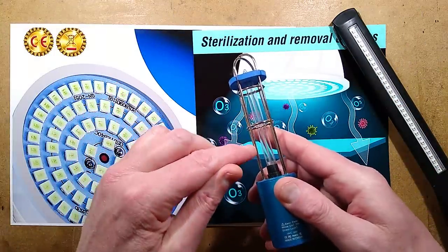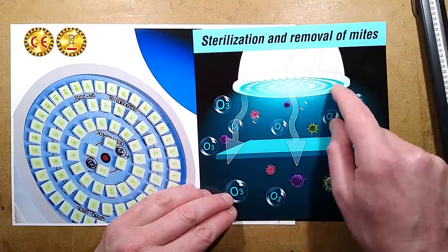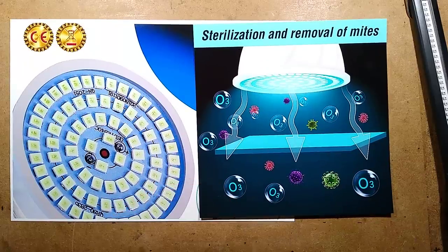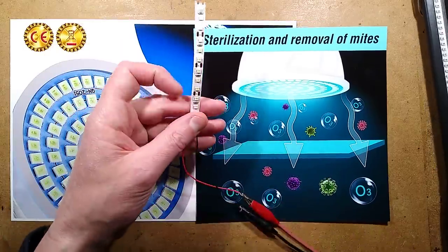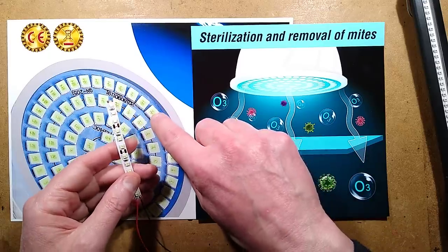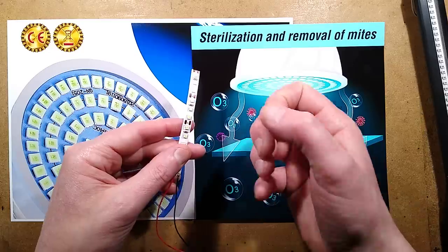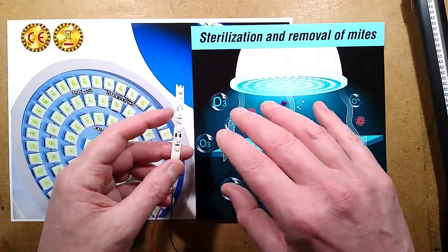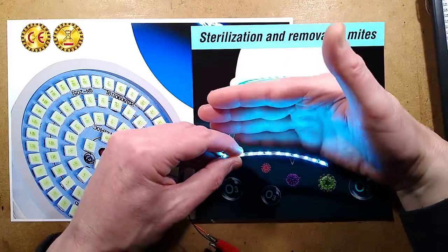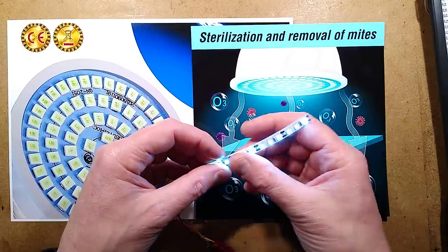These ones are real. The ones with the glass tubes are generally real, the clear glass tubes. But you notice how the colour is very similar? I was thinking, so what are they using then? And I saw these LEDs and I thought, oh, I know what they're using. They're using ice blue LEDs. Ice blue LEDs are basically the same construction as a white LED, but they use the blue chip or an ultraviolet chip, but instead of using tons of the yellow phosphor to create a rich white light, they just use the slightest dusting, so it becomes blue with a slight pastel shade, and it looks like this. Recognize the color? That lovely, pallid, ghostly, ultraviolet-like blue, except for one small important detail.